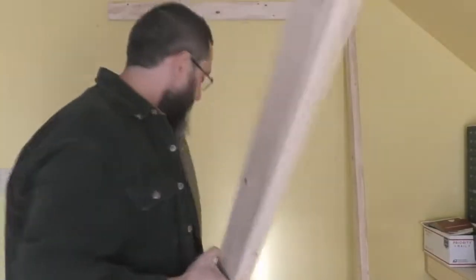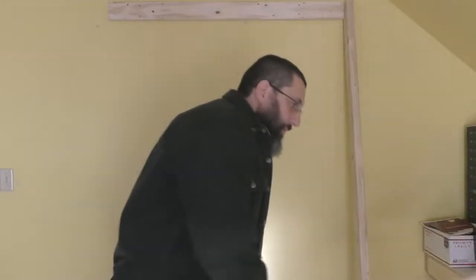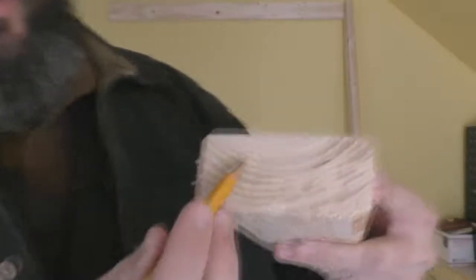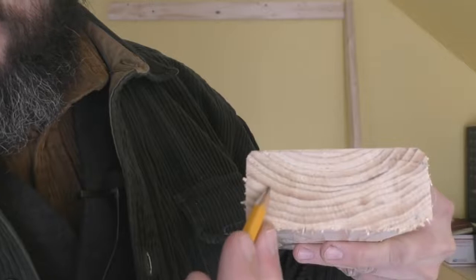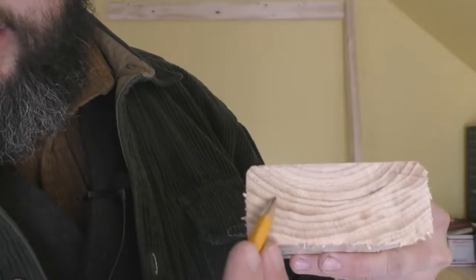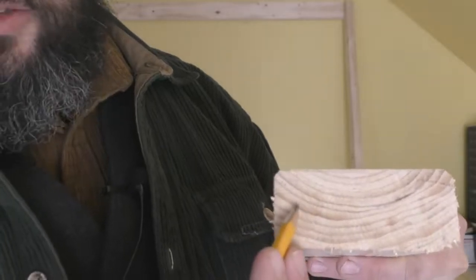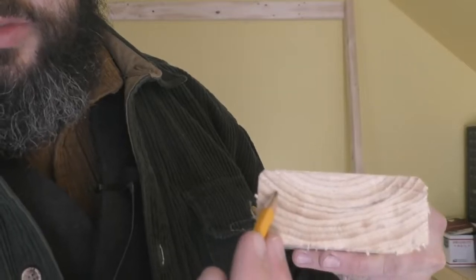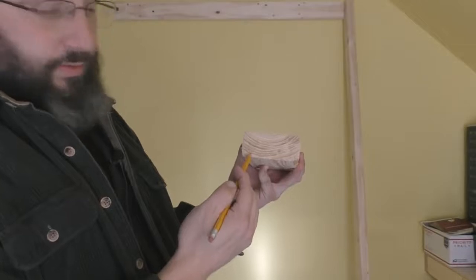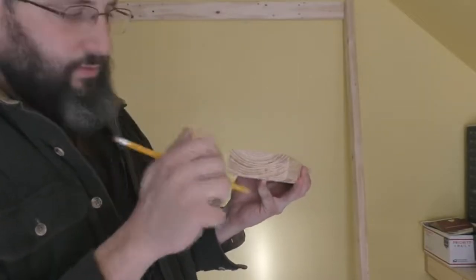The reason I said that is because that's something that's changed. A lot of people don't even realize it. Back in the past, they would actually use 2-inch by 4-inch lumber, and the growth rings were really tight. Just a little forestry lesson here real quickly. This darker ring is called late wood. It grows in the wintertime. The lighter part of the growth ring is what grows in the summer, so it's a lot bigger than the little dark line. When you look at the end of a board, you can see how bad the winter was, as opposed to how much growing in the summer there was. And if you ever look at old growth timber, these growth rings are so tight, sometimes a 16th of an inch. Really, really tight.